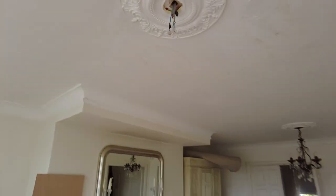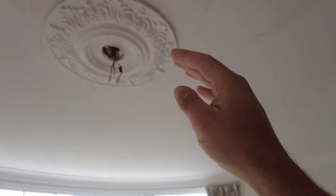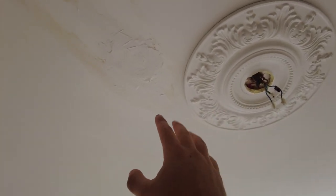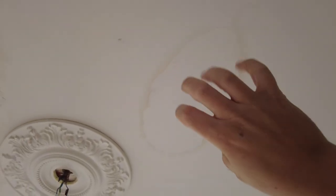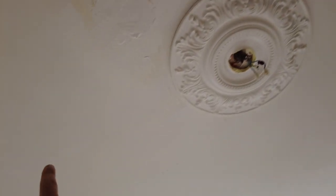What had happened? It kept on leaking and they kept on bodging the repair. This is many months later. I had to take down the light fitting and the ceiling rose had come loose so I removed that. The water was tracking through here, getting further and further. You might be able to see there's hairline cracks — there's one there and one going this way. It also started tracking across here and you can see that water stain with the furriness, like salts. A crack went across there and a crack went across there.